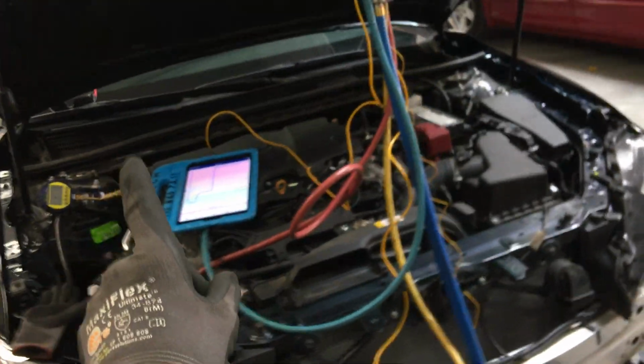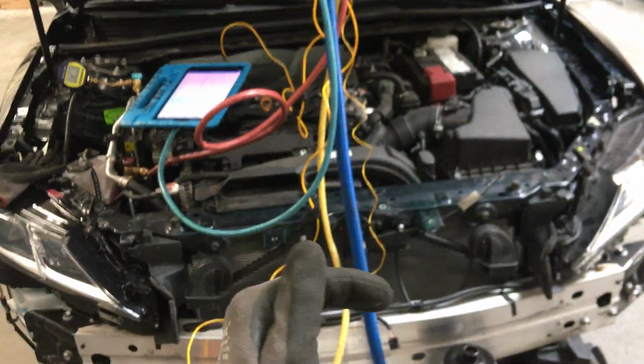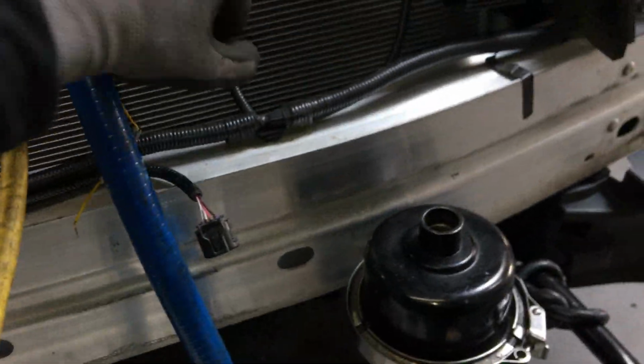Now an automotive system compared to residential HVAC, let's go down to a 3-ton system. Compare a 3-ton condenser on commercial or residential to this. This condenser is about a 1/2 inch thick. Just my finger is almost thicker than I could lay on top of the thickness of this micro channel tube. And it's only 30 inches from here to here, 30 inches. And from down here to here, it's about 28 inches. That's it. That's your condenser.